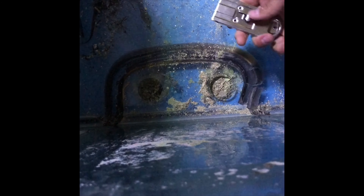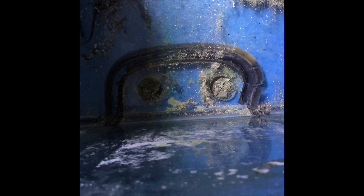I then used the razor blade to scrape off all of the silicone from the tank walls and the bottom of the tank, making sure it was completely clear. What I plan to eventually do is cover the original overflow holes with another piece of glass and silicone it down over those holes. The reason for all of this is that I installed the modular marine overflow into the side of the tank to make it a peninsula style tank instead of a normal 120 gallon marine tank.